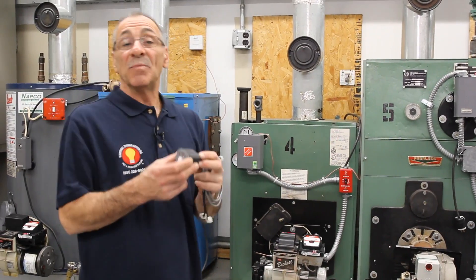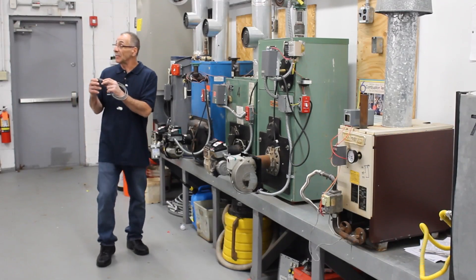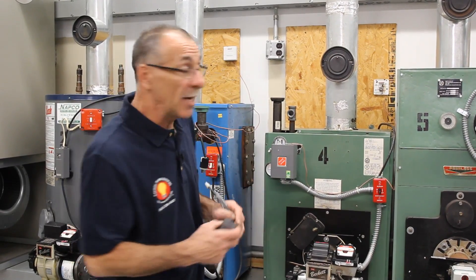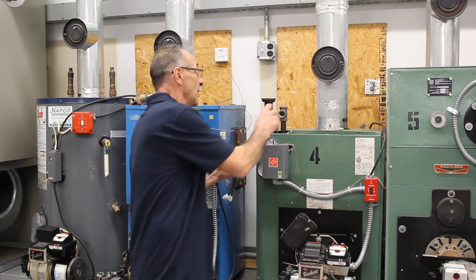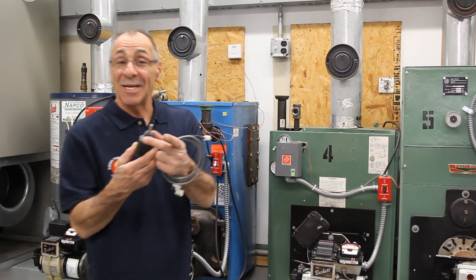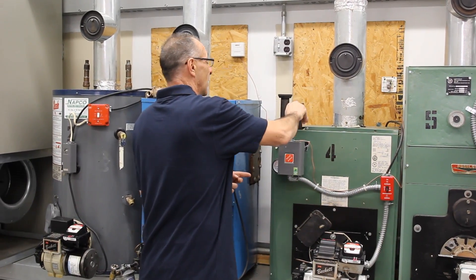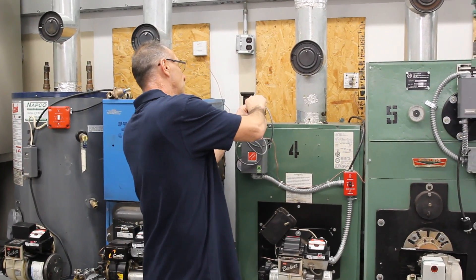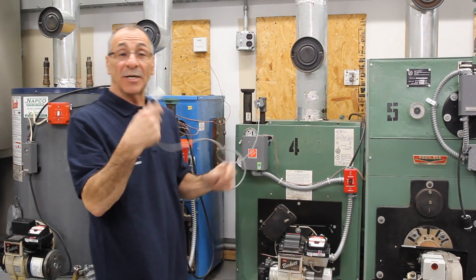This here is the low water cutoff switch. What this device does is it shuts off the oil burner to prevent any harm, injury, or death. The location of this control can be mounted anywhere in the piping within the boiler range. All it is is just a T fitting or two — make sure the water is turned off, then screw it in. Before you screw it in, you do have a threaded connection, so either pipe dope it and/or Teflon tape. We also have a harness jacket — it clips right in. Make sure it goes the same way, and this will get tied into your boiler control.